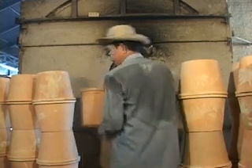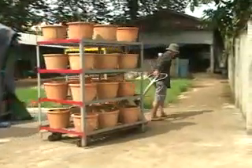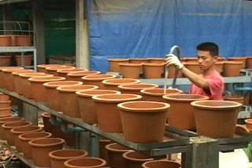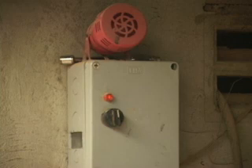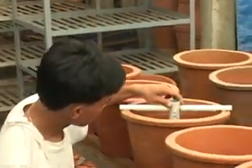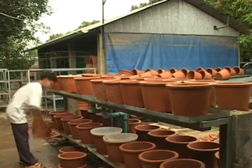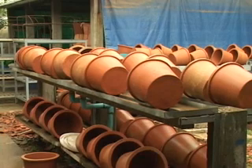The filters are carefully removed and placed back on their color-coded racks, then rolled up to a soaking tank. Filters are soaked in the tank for a minimum of 3 hours, then placed on the flow testing racks. The filters are filled to the brim and a timer is started. At the end of 1 hour, a special measuring device is used to determine the flow rate. If filters have a flow rate outside of tolerance, they are immediately removed from the process. High-quality control is essential to the future of the filters. Filters that pass the flow rate test are dried and then taken over to an area to be treated with a silver solution.